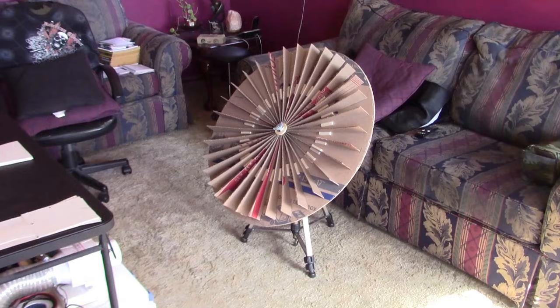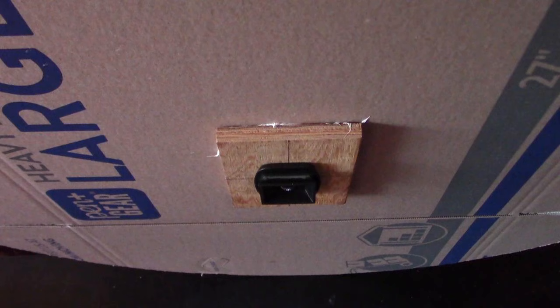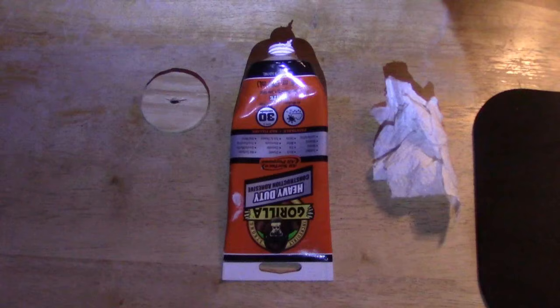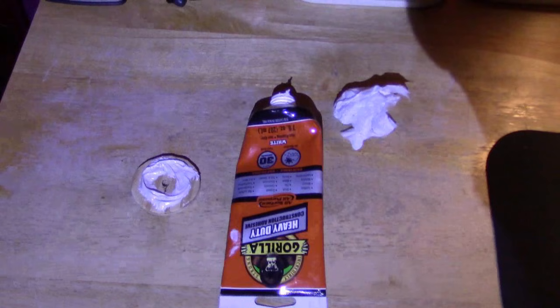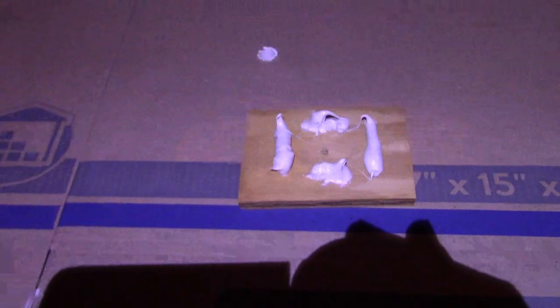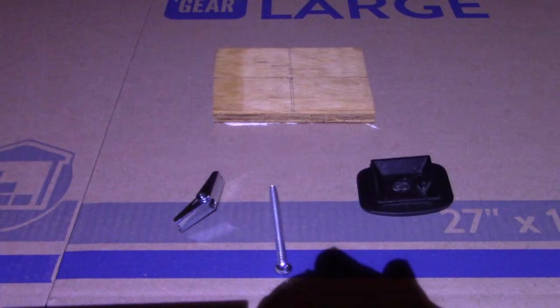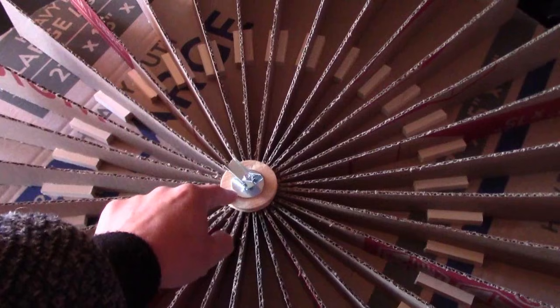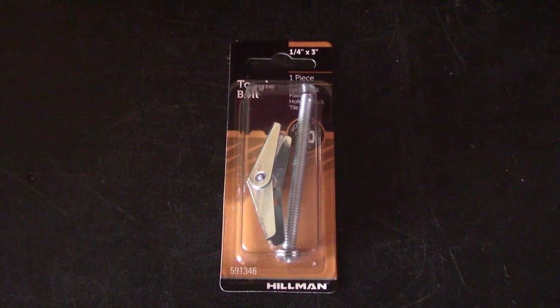From here we do the mounting hardware — a square piece on the back and a bolt that goes through with a round piece on the front. Use construction adhesive; this time I'm using the Gorilla construction adhesive. Take the back piece, drill a hole in the center, flip over the collector, and drop it on with the construction adhesive. Then grab the bolt and the mounting plate, put that on the back and drop the bolt through, then drop a washer on and finally the nut — or in my case I'm using a toggle bolt with a toggle wing.